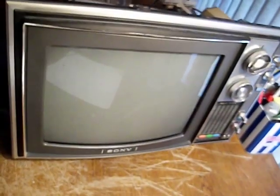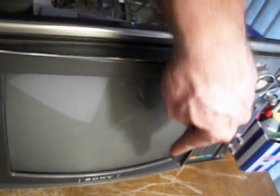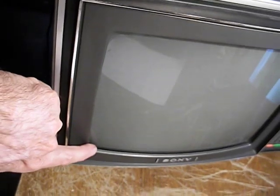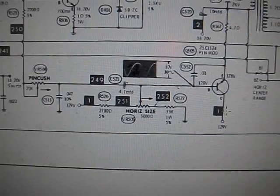I hate this large cap — I don't know what it does, but I don't want to see a problem. I think it might be some kind of filter cap. I can't remember what that's for. I can get a picture of the front here so you can see it a little better. I'm going to get it all cleaned up and get ready to replace those caps. The picture is working fine except for the oddball pin cushioning. I don't think it's correctable because it was actually pin cushioned weird — it kind of came up and out as opposed to just a regular symmetric pin cushion. A normal symmetric pin cushion adjustment would have a bow in, but this one's more like up and then bowing out, which tells me that cap is failing. The real test is: does the pin cushion adjustment correct it? If it doesn't, then clearly the cap is bad.